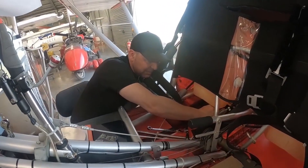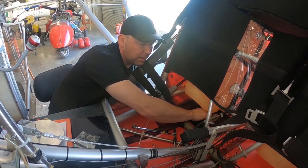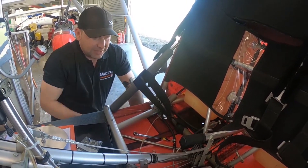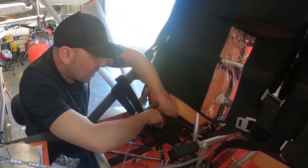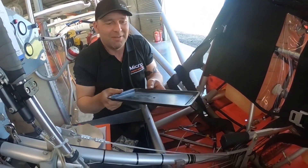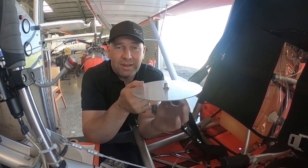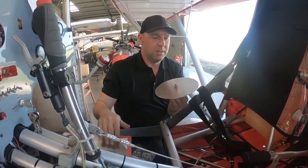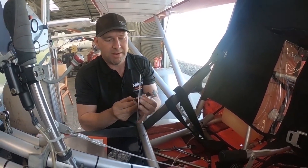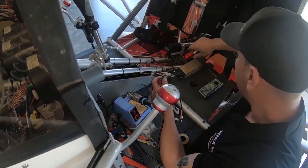As you can see we've got the full avionics system all set up — fantastic. Now we're getting some aerials in. We're going to relocate the transponder aerial so it's to the centre and a little bit more to the rear. I have certain OCDs which I can only apologise for — so we're taking out this baking tray that's been used as a ground plane, very ingenious, and replacing it with a micromaintenance very light aircraft aluminium ground plate. We've got three of these to go in — one for the transponder and one for each of the PilotAware aerials. We're plugging everything in now and have one of our famous under-seat boards in — looking good.